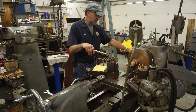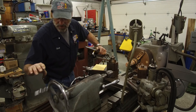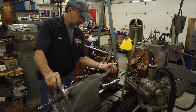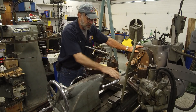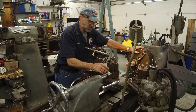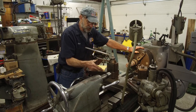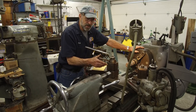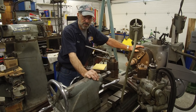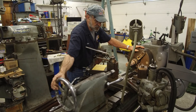She is running really pretty true — I can't physically see any runout on her. It's going to be running true enough to machine that off. We lost a live center in the move; not necessarily damaged in the move itself, but I did pressure-wash the machine. The first use of the live center I put it in on the part marine shaft I was making and it melted the end right off — the live center had locked up.